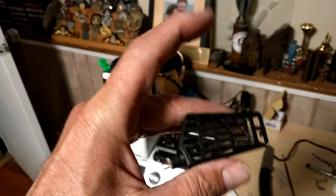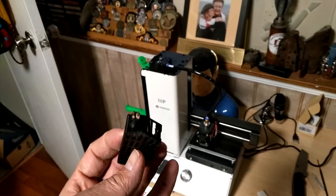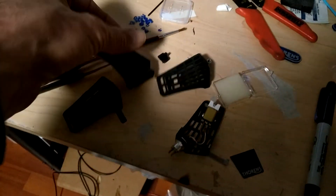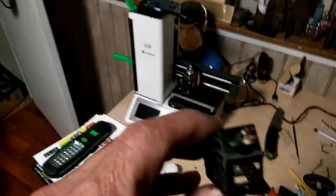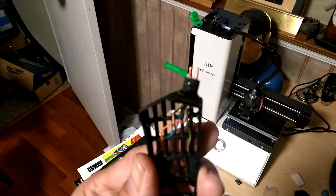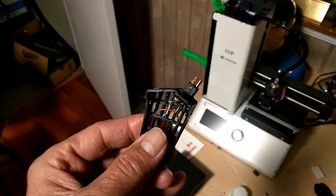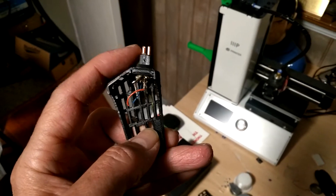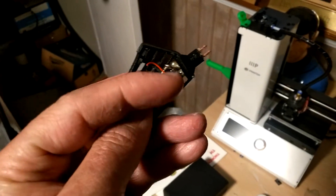The first one I built didn't have the finger lifter. I also made a version with an 8mm stub and four holes that coincide with the exact measurements of the pins on the original headshell's bayonet connector to the tonearm. I used sturdy copper wire straight through those holes in the extruded 8mm plastic bayonet mount for the tonearm.